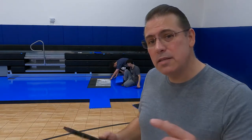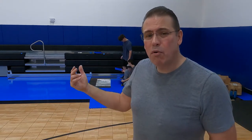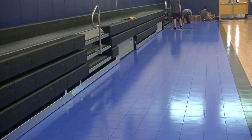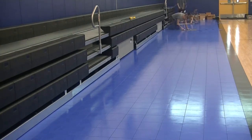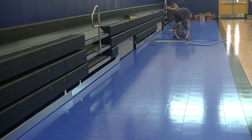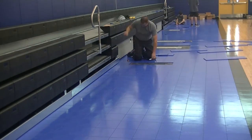We're not putting these everywhere — we don't need them everywhere. We're simply putting them where the wheels of the bleachers are. It's probably about a three or four hour process to install all of these on a Saturday afternoon. I identify the areas of the floor that need to be reinforced, then remove the flooring and cut out the rubber underlayment. My boys follow behind installing the bleacher block and reinstalling the flooring I have removed.